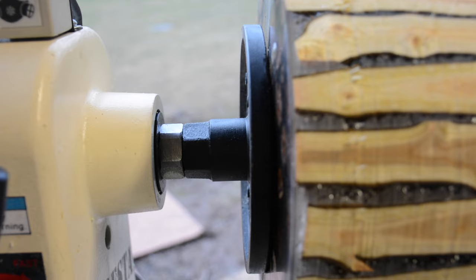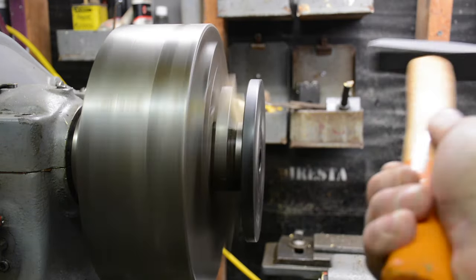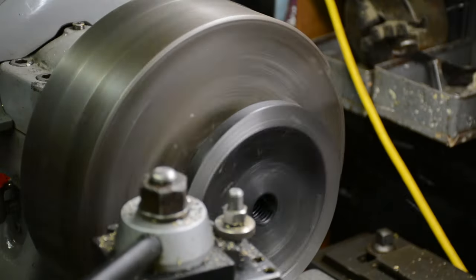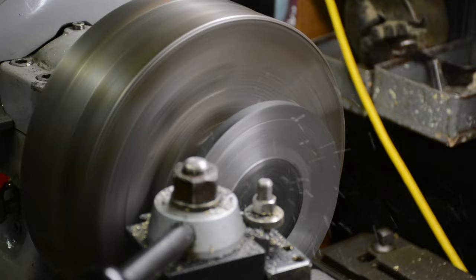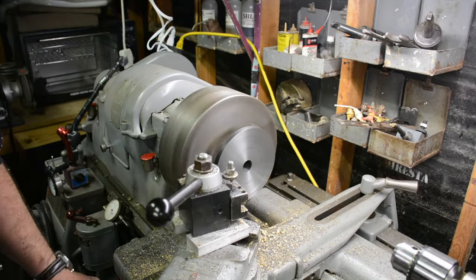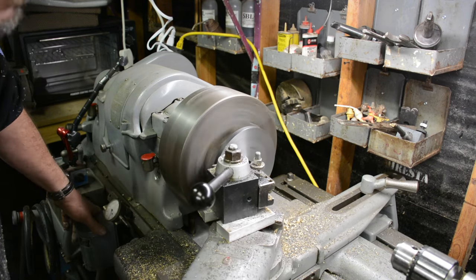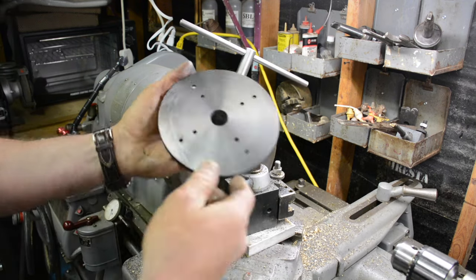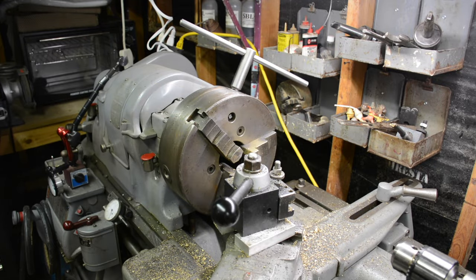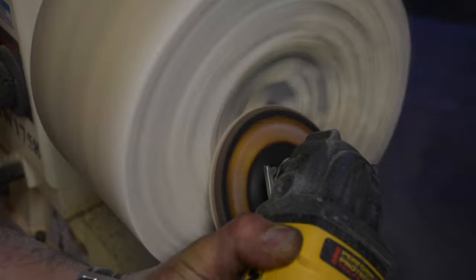You see my attaching plate bent. So I bring it over to my South Bend lathe. While it's spinning slowly I whack it a few times and get the bend out most of the way. I just face it off two times to get it nearly flat but not perfect — it's a cast plate and I already cut off a substantial amount of it, so I live with the little wobble. I got out about 80% of the wobble, and I realize chisels is probably not the way to go.